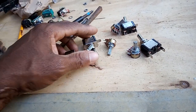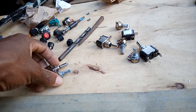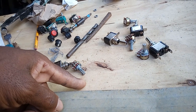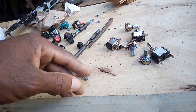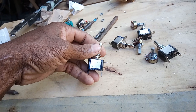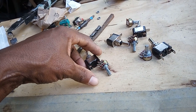The reason why I'm doing this, I want the signal from the DriveRack to come through here, each one here. So the tweeter line is going to go to the tweeter switch, tweeter volume. So once I turn on the tweeter amp, I can turn the volume up and down. Before reaching the DriveRack, I need an expander gate there. The expander gate is going to cut all noise from the sound. You never hear me play some sound and hear the fan running in the background. No. Before reaching the DriveRack, there is gonna be an expander gate. So that is the reason why I have this control here, you know what I mean? I have a limiter also. The DriveRack itself has a limiter also, so you can't turn up the sound any louder. Only you can do that.